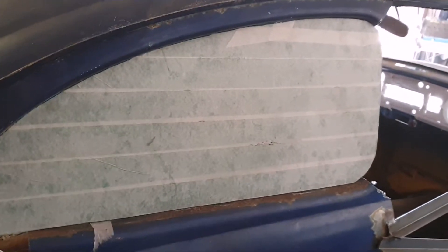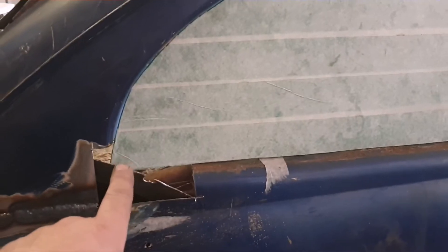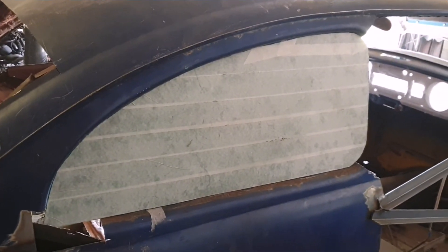That's tacked back together now. I'm pretty sure this is the same height as the other side. I'll keep that template — 25 mil off each side all the way around should give me the window cut. Quite a handy little template. I've left this corner on so I can make my radius, cut it to match, copy it on the other side, and they'll both be the same. Not a big project today — it's Saturday, so I'm going home.